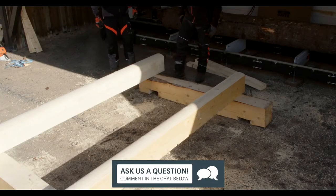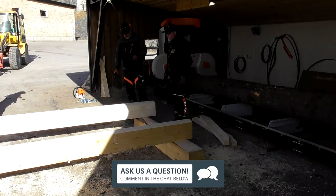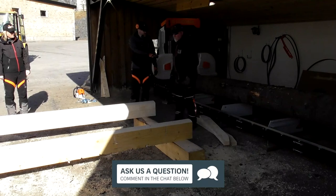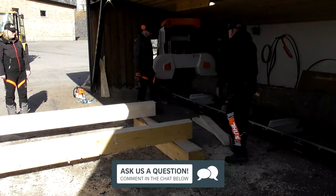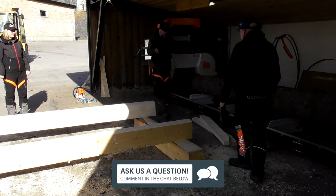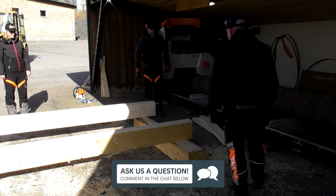Almost. I'm going to attach them to the beams on the ground. Take out with a chainsaw so it gets a little bit more stable. So you're going to make grooves in those beams in the bottom. Yes. So they fit in there, and then between the log table and the frame of the bandsaw mill. Yes. Some sort of loading ramps. Because you want to have it free over here because you're walking on this side. But, of course, something to put there when you want to load another log on there.